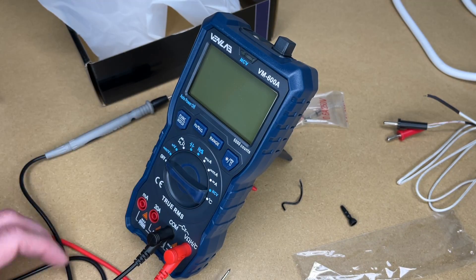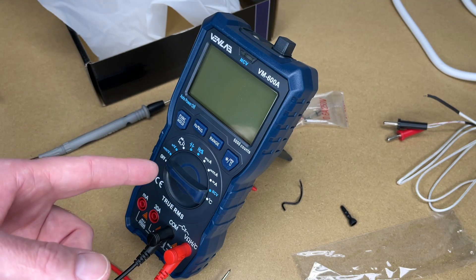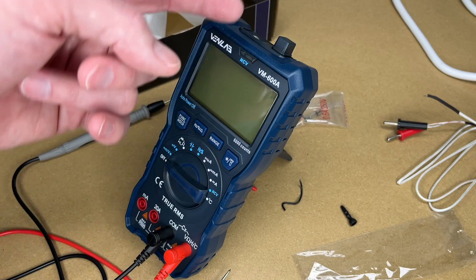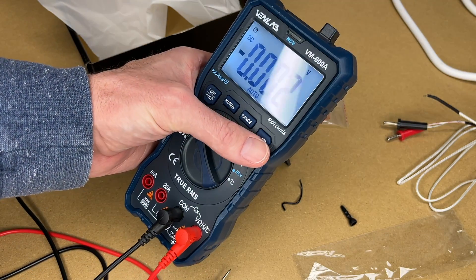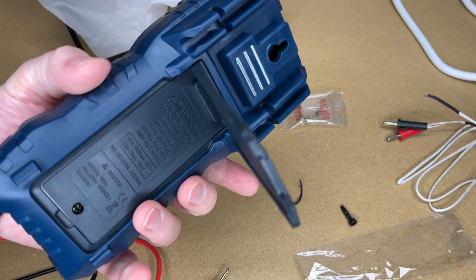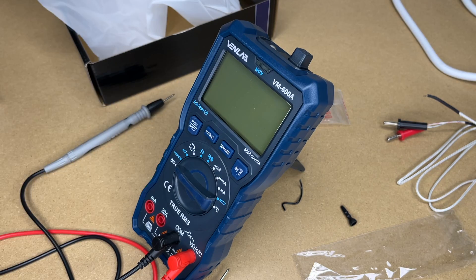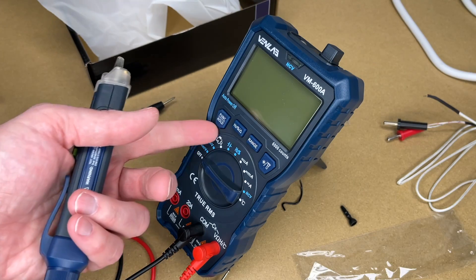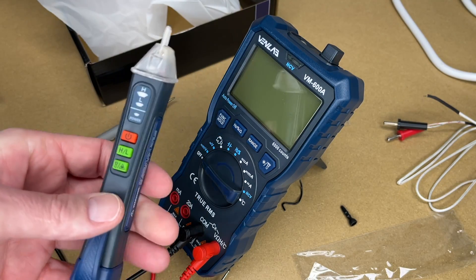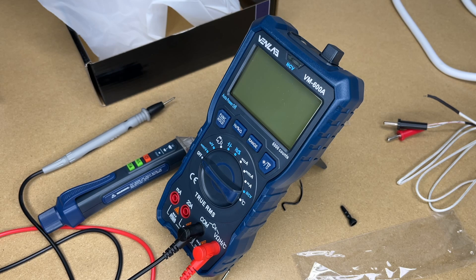So that's the Venlab digital multimeter. I really like that this is a full function multimeter — it has the things you'd expect like volts, ohms, continuity, and amperage, but then it has things you don't find in all meters like capacitance and non-contact voltage. It has that backlight and flashlight, and as I get older I appreciate when screens are easy to read — that large display with the backlight makes it super easy to read in a dark area. I like the rubberized coating — it makes it very durable. There are lots of applications: electronics, home repair, appliance repair, and automotive. Then of course we have the non-contact voltage detector — sometimes a meter is more than you need. If you're just replacing a switch, you just want to know if there's any current, and that's when you use a tool like this. If you have any questions, please leave them in the comments. If you like this video, click like, and if you haven't subscribed, I'd appreciate it. Thanks for watching — until next time, goodbye.